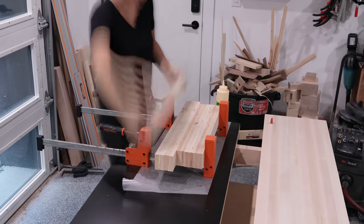For the first piece in this glue-up I used wood glue and CA glue — the CA glue acts as a clamp and quickly sets so I can push all the spacers and rest all the pieces up against that first piece without anything sliding around. Then I added the top walnut piece, clamped it all up, took out the spacers so they wouldn't get stuck to the glue, and set it off to dry. When I milled these pieces I milled them slightly wider than I actually need so I can clean the whole thing up after the glue dries. One pass on the jointer, then cut to final height at the table saw, and bring to final thickness at the planer until it slides right between the two halves of the bench.